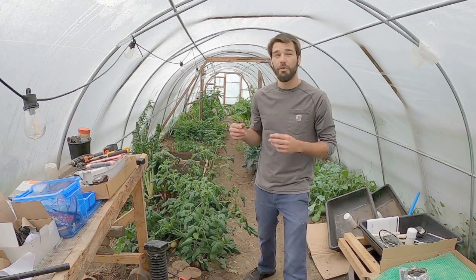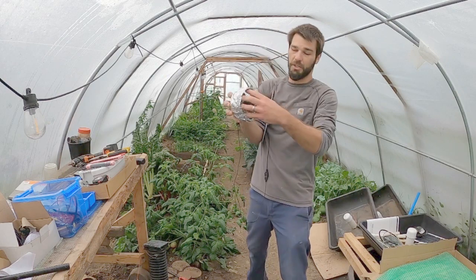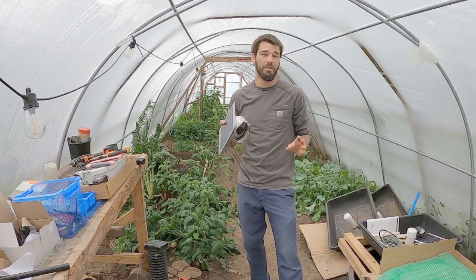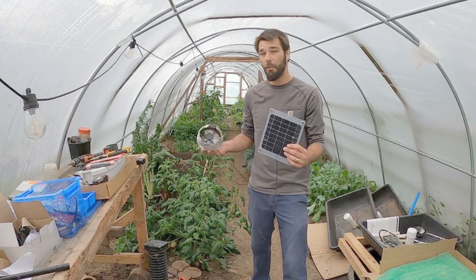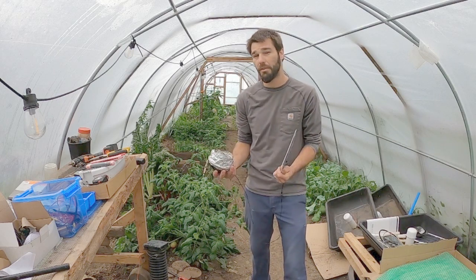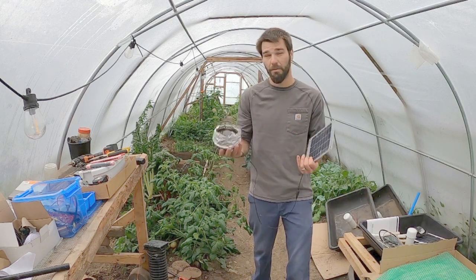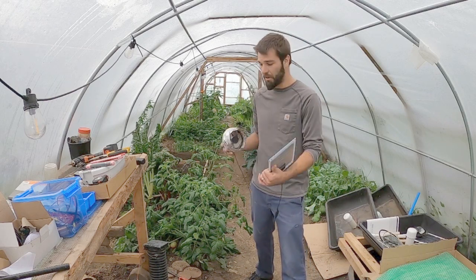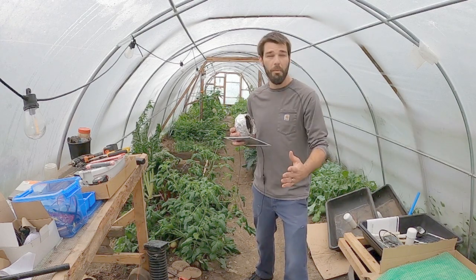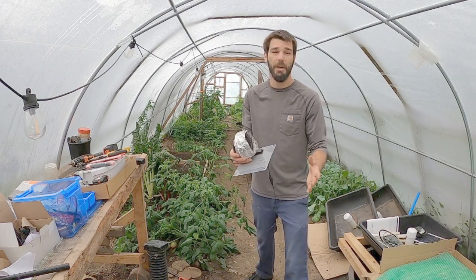I added a new fan because I was previously using a cheap 5 or 10 watt solar-powered fan with a metal tape gasket. That worked well until we put our shade cloth up and lost the solar activity that was making it crank — it would spin but not draw much air. With this new system we should have better longevity, more power, and we'll be able to run through the night on a timer, running our water, geothermal fan, and compost heating all off the same system.